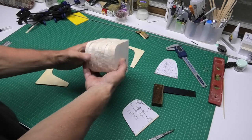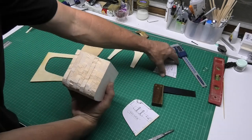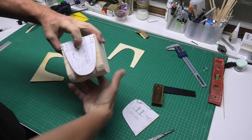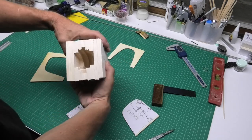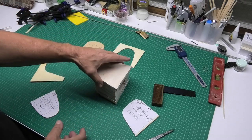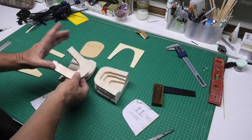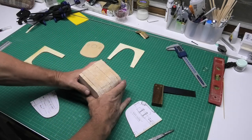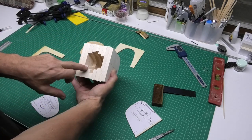I've done nine of these to give me the side view and enough width to carve out the shape from the top. I've also cut out the centre of some of these — the first two are whole, and then I've taken out progressively more. Originally I was thinking I would take out more than that, but I'm slightly worried I'll take out too much. So I've got a start there for hollowing out, and I can use a gouge.